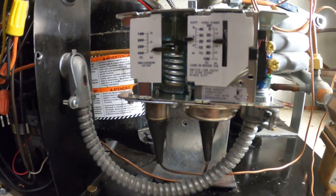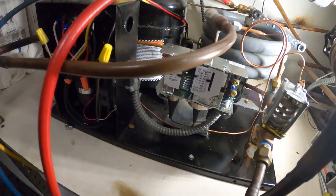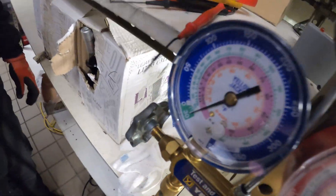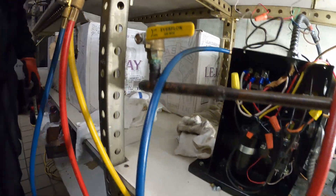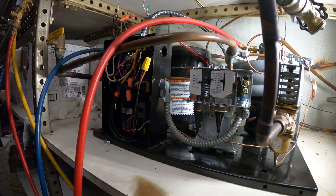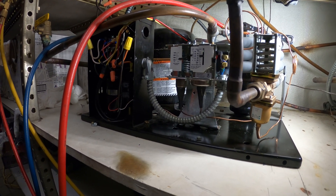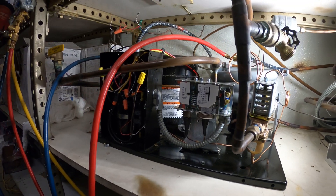We ran the power into the control and connected our two wires — we are going to need to adjust it. Got a vacuum gauge on here and it's looking pretty good — we're already below a thousand microns. That's a beautiful thing. Let's just continue running that vacuum, then close everything up and get this thing started.